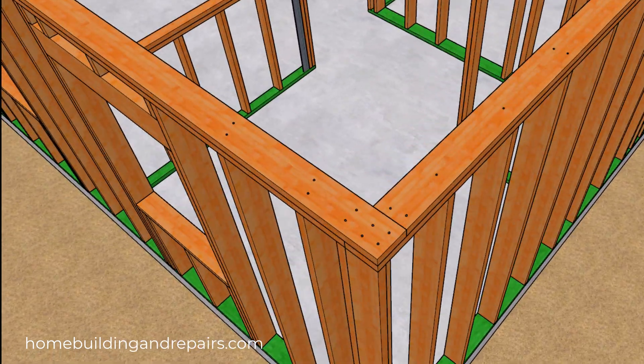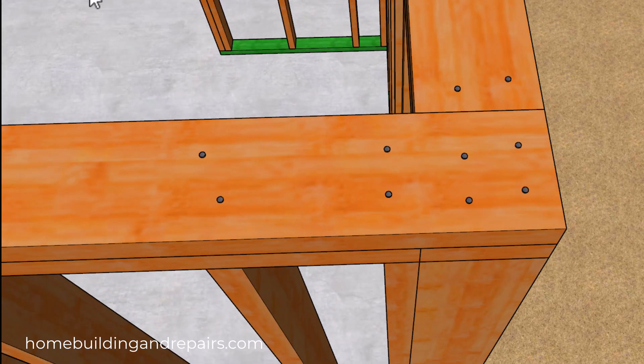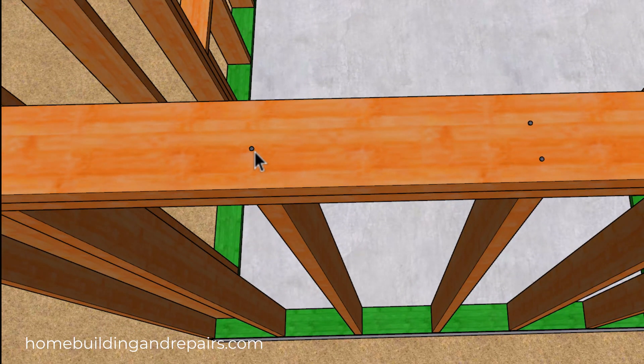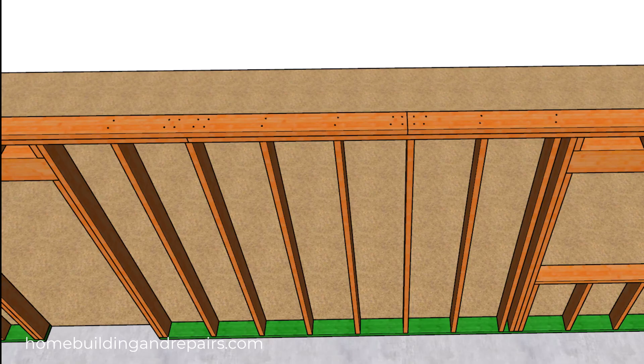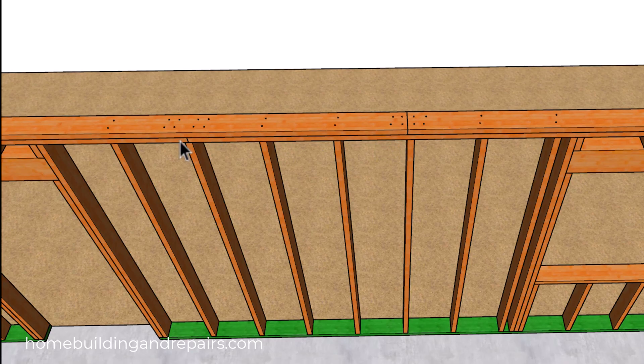Heading over to the corner — I'm giving you ideas on how I would attach this stuff together. I've met framers who use one nail in the center on two by sixes, and then every once in a while they use two nails. I haven't found any nailing codes for that, so feel free to share them in the comments. In some areas this plate break only needs to be two feet and does not need to be four feet.